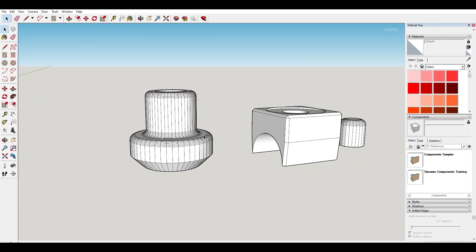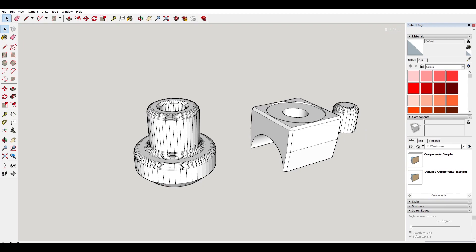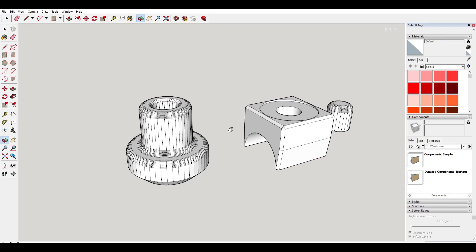Just got to make sure you have plenty of material between the bottom of your bore and the top. With TPU, the material is so strong you don't need to have that much there. I'm going to stop short of saying it's indestructible, but I've never managed to pull apart a TPU print that I've printed. I've squeezed them in the press and the vice and they always come back to the original shape — it's amazing stuff. If you haven't printed with it, check it out. I'm glad to say that after four years in my yard, it's holding up to the elements as well.